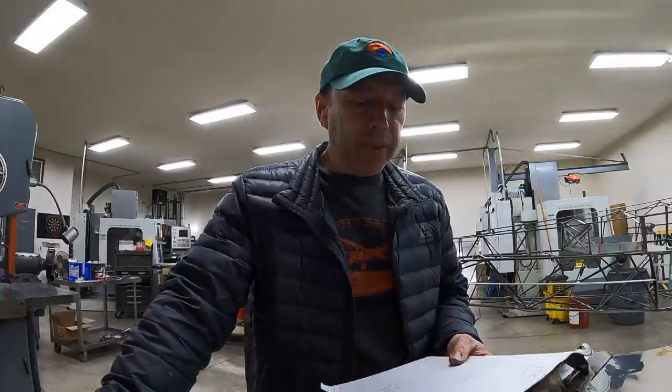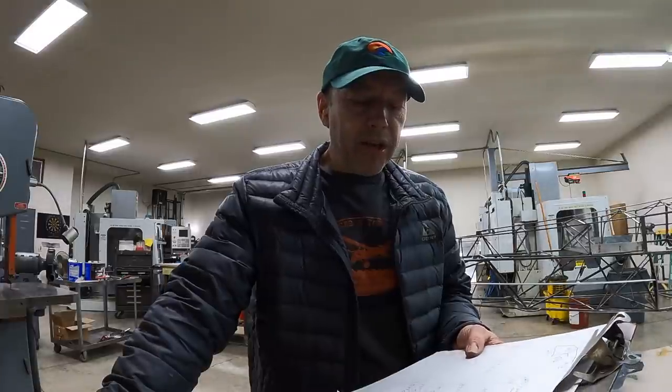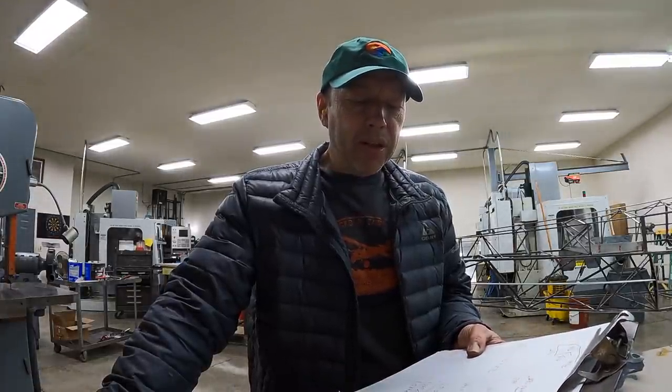I just did a quick calculation. 0.016 aluminum is 0.230 pounds per square foot and 0.020 aluminum is 0.288 pounds per square foot — not a big difference. This area is about 792 square inches, which works out to 5.5 square feet. If I do it in 0.016 it'll weigh 1.265 pounds, versus 0.020 which will weigh 1.584 pounds — so it's about a quarter of a pound more for that area. I'm going to make it out of 0.020. Even if I still have to reinforce it, it's going to make it stiffer, so it's going to be better in the long run. I'm all about saving weight, but a quarter of a pound here or there I'm willing to sacrifice for a little bit of strength.